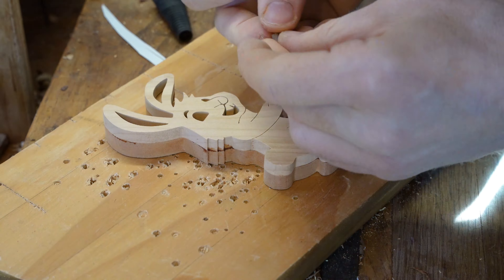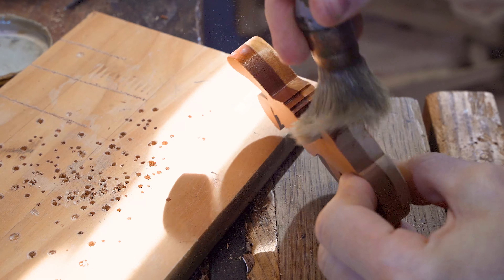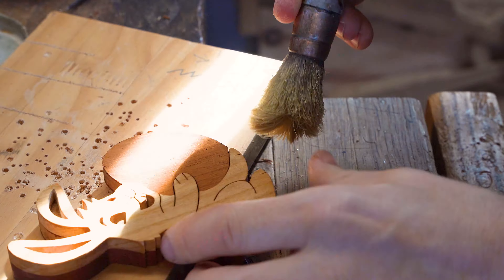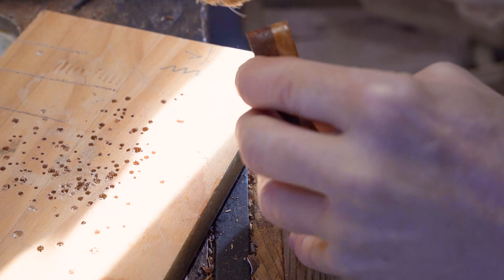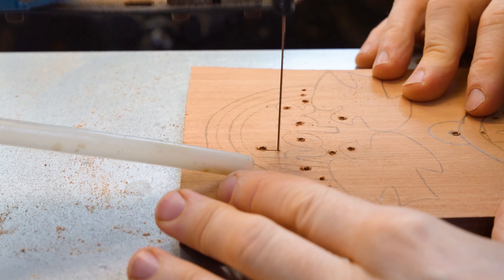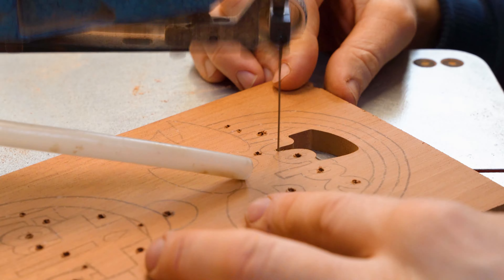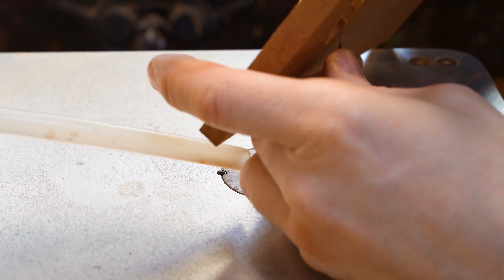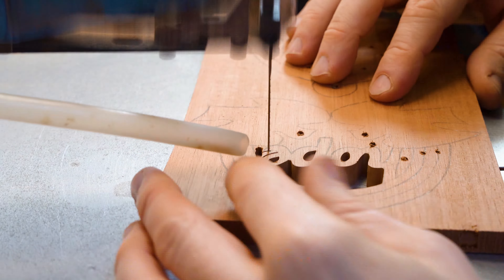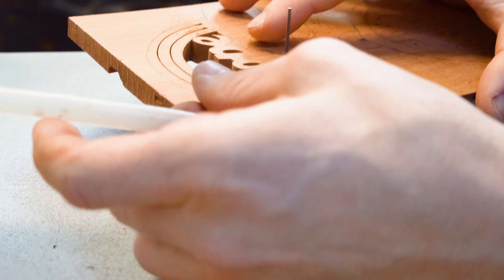The reason for this is we're going to use the back layer as the front of the Easter egg so it'll contrast nicely with the colour of the top layer. We're also going to add a third colour — just a few little pieces of teak — for the eyes of our rabbits. Afterwards we sand everything down smooth and stick our project together using super glue. We stick the top layer to the back layer, then the Easter egg to the front, and then the eyes in position. Same as all our projects, we finish with two coats of shellac sanding sealer, rubbing down in between, then a finishing coat of linseed oil mixed with beeswax.